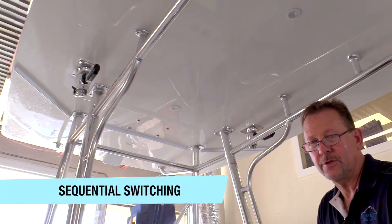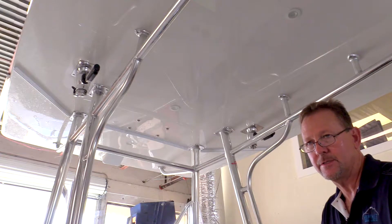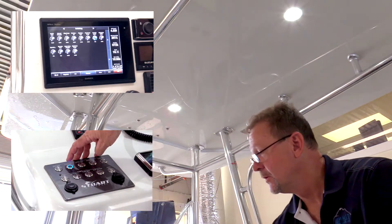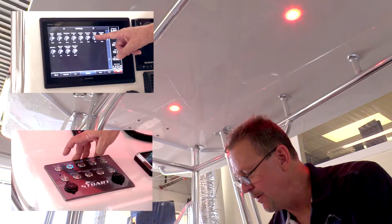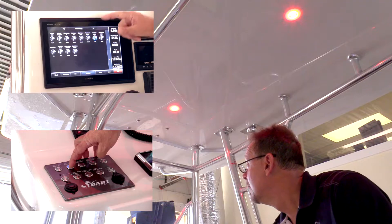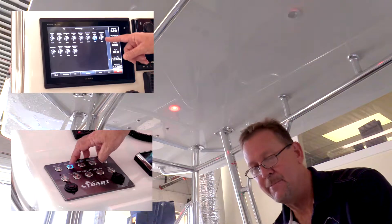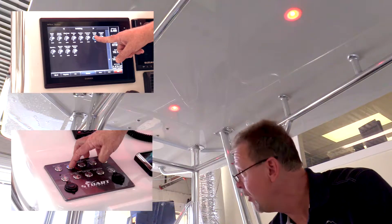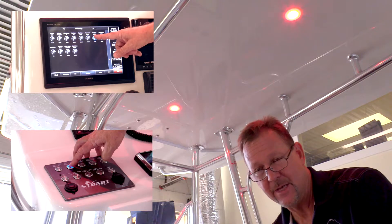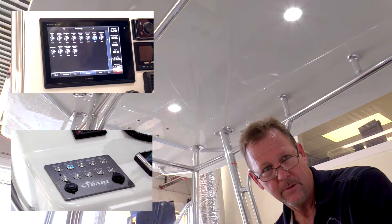C-Zone provides some unique circuit control features. One of these is sequential switching, where you can use one button to select several circuits or scroll through a circuit. Starting with the hardtop lights — if I turn them on with one push, they default to their color. If I quickly turn them on and off, they default to the next color. With that same button, while the circuit is on, if I hold it down, the light begins to dim. When I release my finger, the light stays at that dimmed level. If I hit the button again and hold it while already dimmed, it increases back up to full or until I let go. I can use that same button to hit it and let go quickly, and the light will turn off. Next time I turn on the switch, the light will default to its original color of white.